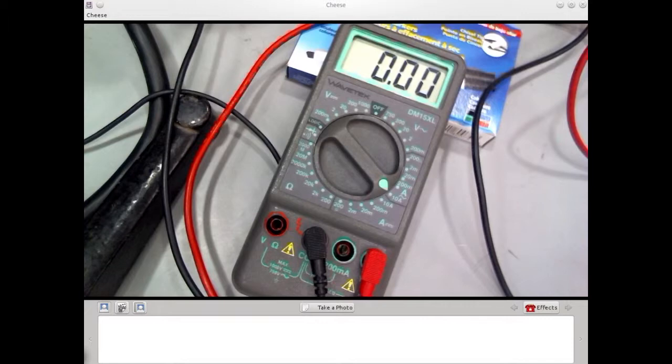Let's move on to series. The first exercise won't come as a huge surprise. You want to calculate the total resistance of this system to find the current moving through the circuit. From conservation of charge: if current is driven by the electromotive force, whatever goes into R1 comes out of R1, goes into R2, comes out of R2, and goes back to the source. The current going in has to be the current going through here, through R2, and back — because charge isn't leaking anywhere and there are no branches. So in series, from charge conservation, we expect the current to be the same everywhere in this circuit. Calculate R_total and predict I_total.